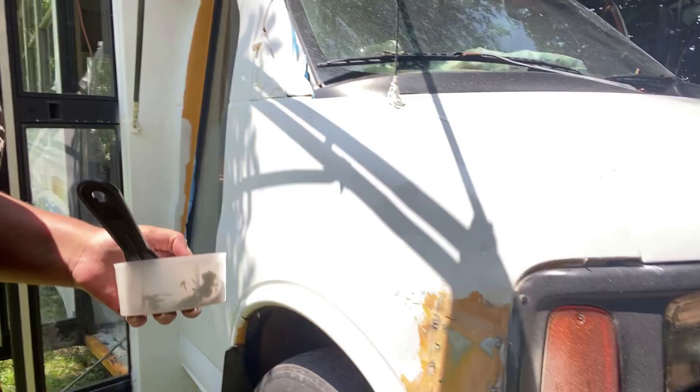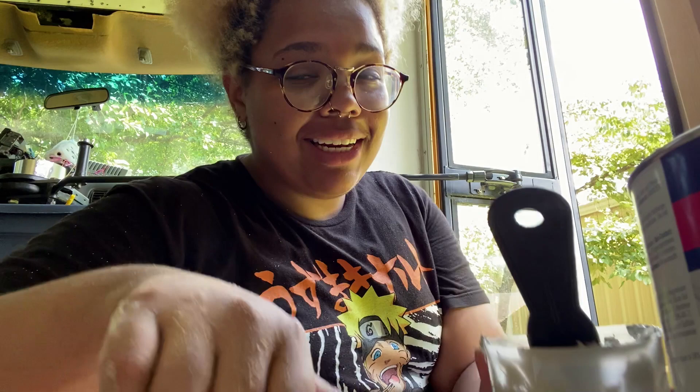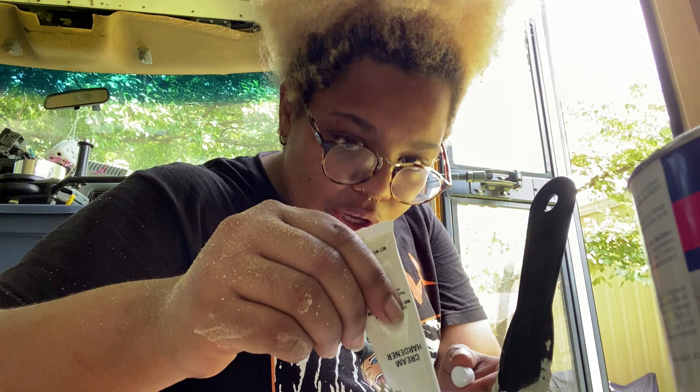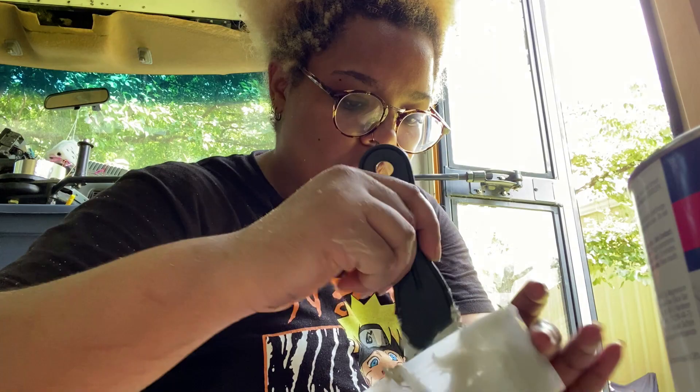As you can see it is nice and sanded, so I'm going to start filling up these little holes. This stuff is drying super fast, so I'm going to put an even smaller amount of the cream hardener. That's all the hardened cream behind the lighter-toned cream right here. I'm literally going to put like two little bloops — maybe not even that much — because it's drying so quickly and I'm also in the heat, so that's not helping.